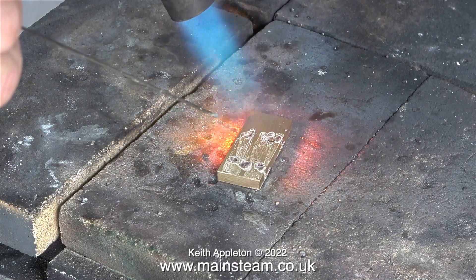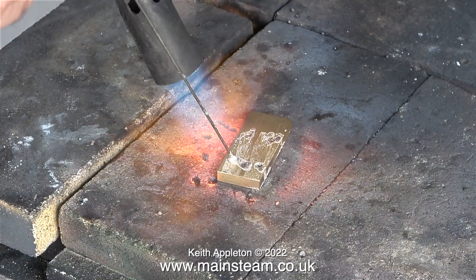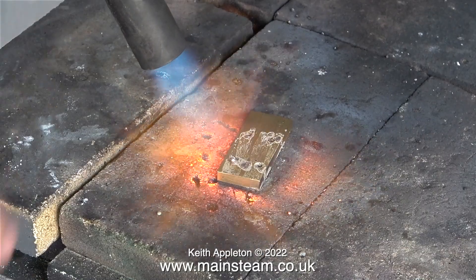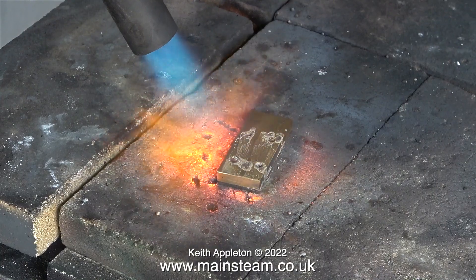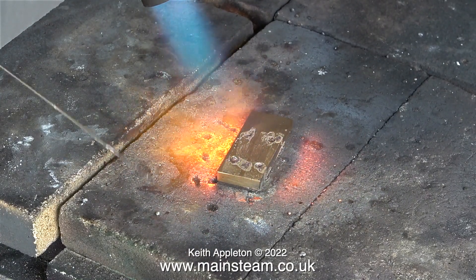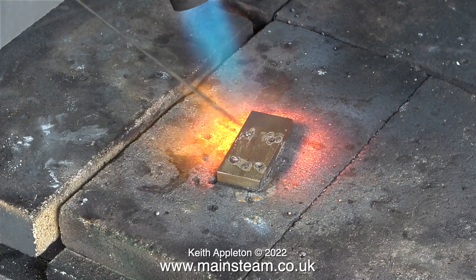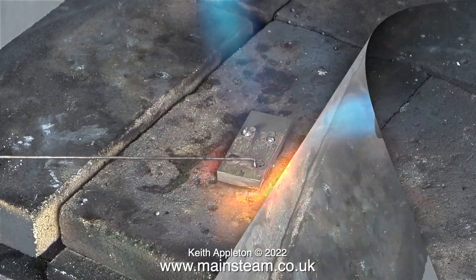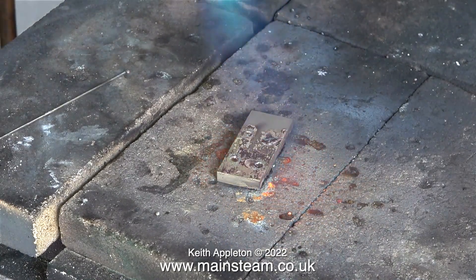It takes a while to get this component to the required heat to melt the solder. I'm going to apply some silver solder to one of the holes to show you what happens. The heat from the blowtorch melts the silver solder stick at the end, but the silver solder does not flow into the hole — it just sits on top like a ball. Normally I would wait until the flux took on a watery appearance before applying the silver solder, but for the purpose of this tutorial I am applying it too early, as I've just mentioned. After a while, as the piece of brass gets a lot hotter, something starts to happen.